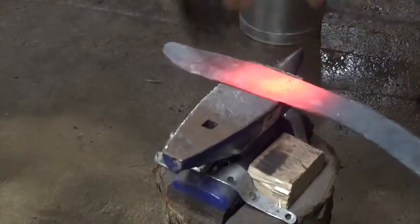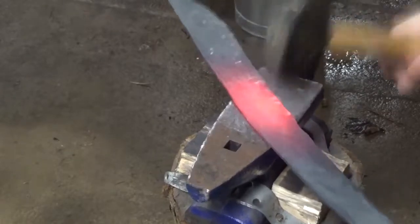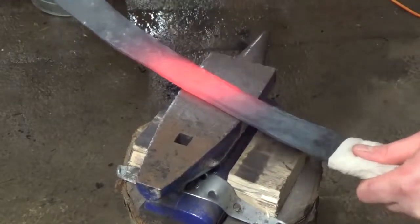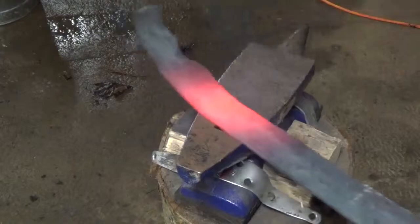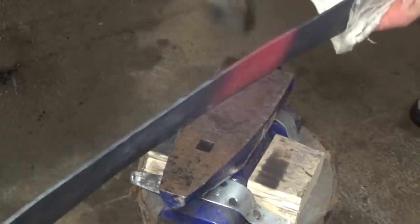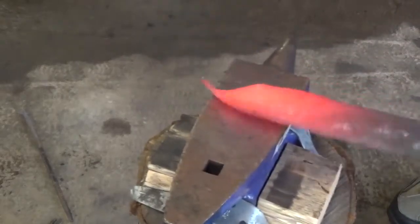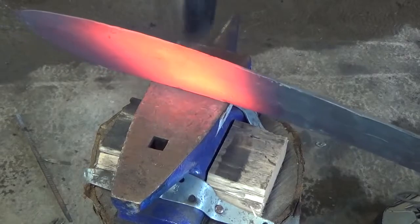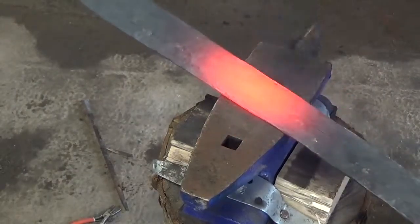Now I'm working on my main inside bevel, and as I work on it going down the blade I'm actually starting to straighten it out — as I increase the amount of bevel on the inside curve it slowly forces the blade straight. With the bevel established I clean up the curve in preparation for the final pass. I bring the point forward so that I have a nice forward curve and then start working on the width, thickness and the taper of the blade. I'm trying to do as much as I can because the only grinding I'm going to do is on the edge and the bevels.